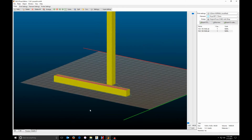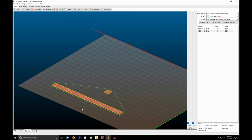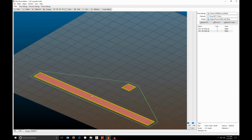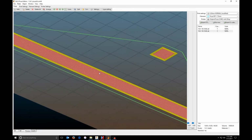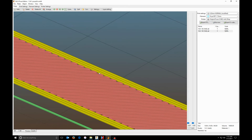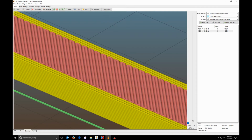Okay, we're going to look here at what I think I've shown before in my slicer program. If you look at something that's printed long ways and the layers just make up the thickness of it, you're going to have a lot of strength, because imagine stacking a whole bunch of layers of plywood on top of each other and then the bending forces. But you have to keep in mind the height of the object is going to basically give you your strength because of the thickness.